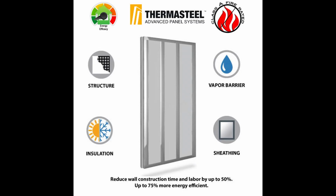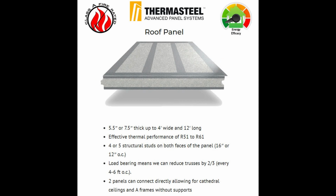We're going to take a look at the roof panels now. Here's the roof panels, and they average between 5.5 and 7.5 inches thick, depending on your climate region. And all of this is engineered by both ThermoSteel and Fast Frame to make sure we're putting the right product in the right climate zone, and also to meet the requirements of your building plans.